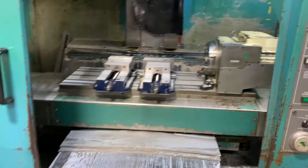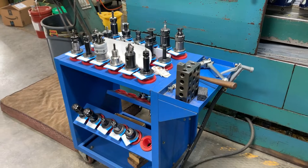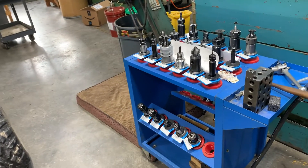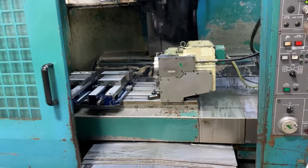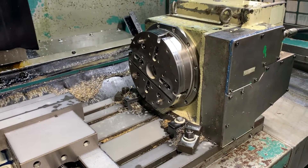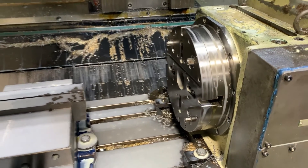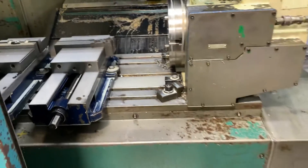On this particular machine I have tooling that remains set up. This machine cuts slides and frames, so I can pull my slide tools out, label them, and put my frame tools in. The offsets stay in the machine, and on my fourth axis I've got a quick change adapter plate with three pins so that you can quick swap fixtures and don't have to re-indicate them. So this is kind of a dedicated machine for slides and frames.